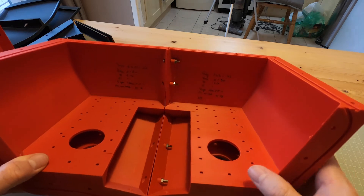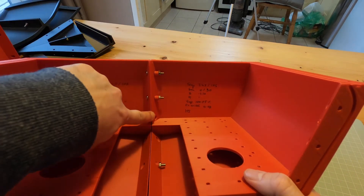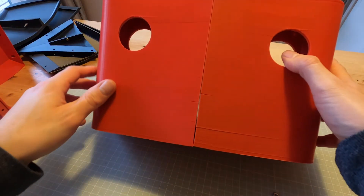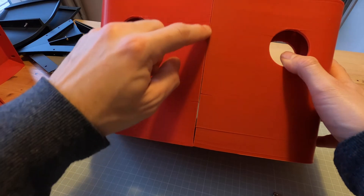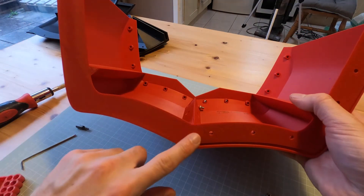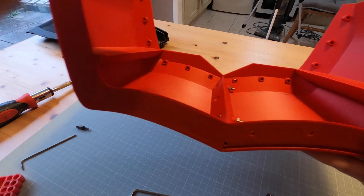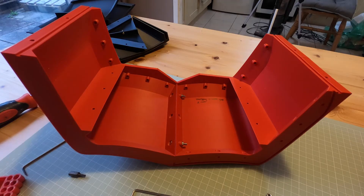This is one of the best examples of warping. We can see here we've got a good join there, it bows out where it's warped on the edges and then it bows in again at the top. You can see it well on the bottom where it bows out and in and then out and in again. This piece was actually incorrect as it hasn't got any holes in there, so I'm actually going to have to get the drill and drill those, but for now we'll carry on.